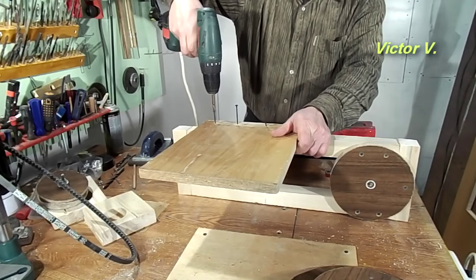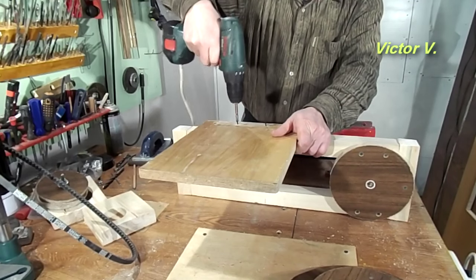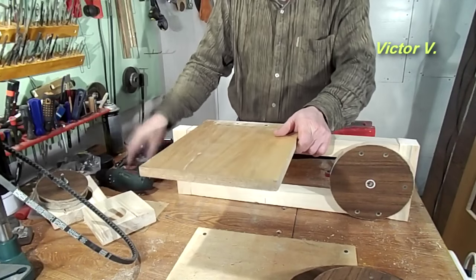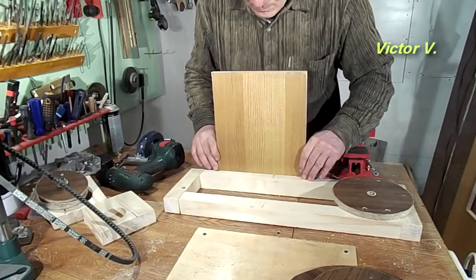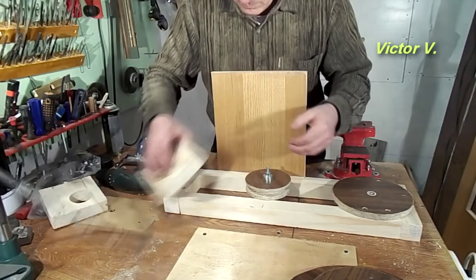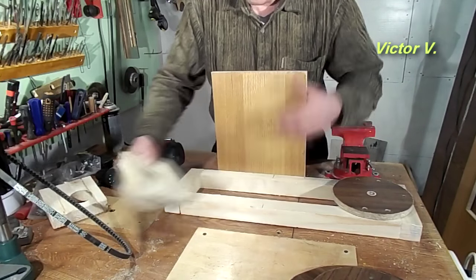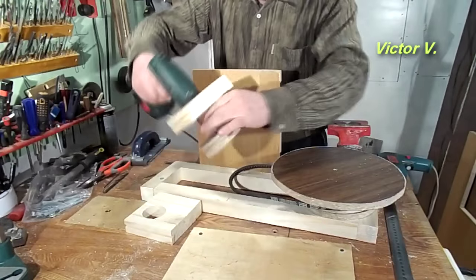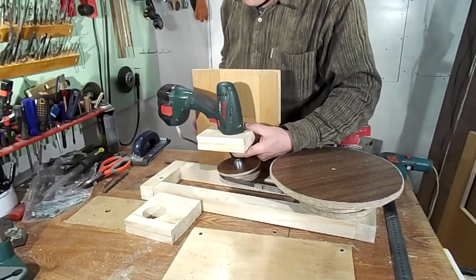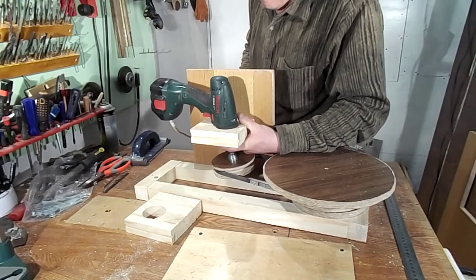As I said, the friction unit is lubricated with engine oil. This machine works a short time, so it's okay. Remember, 100 years ago, these wooden bearings were used in the wheels of locomotives and other places, and served for a long time. However, if you need to increase the duration of work or a light rotation, you can make it with bearings.